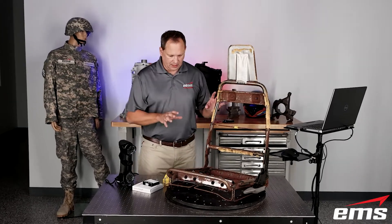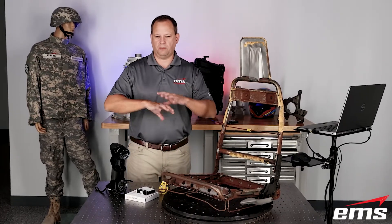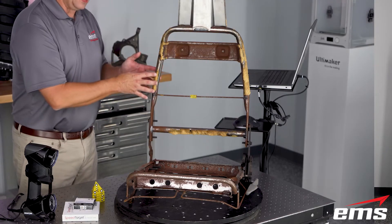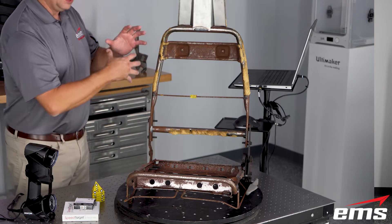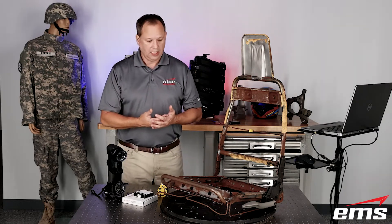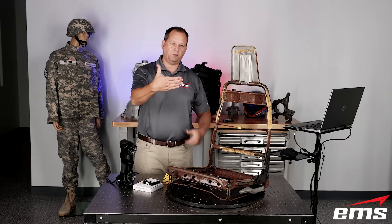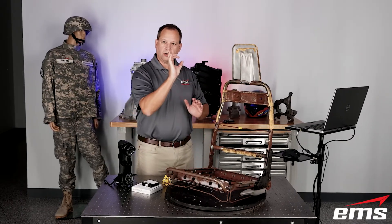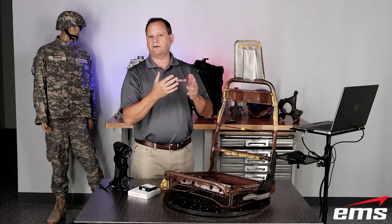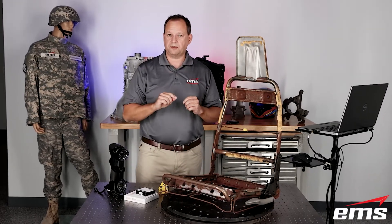When we take a look at this automotive seat frame, the real challenge is it's basically tubular. Whether it's like a race car chassis or automation equipment where you have things that are kind of thin and round, they're kind of spread apart. The challenge is basically moving around because with the HandyScan series and a lot of scanners, you have to see targets. Trying to put targets on really thin areas or on round surfaces is a problem — when you put a target on a round surface, it's no longer flat. It's a very specific 6mm diameter the scanner is looking for, and when you put it on something curved, you're throwing it off. The scanner doesn't see it as a 6mm circle or diameter.